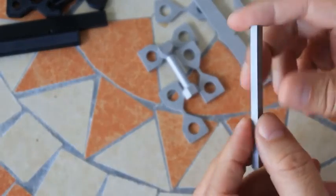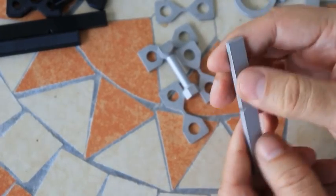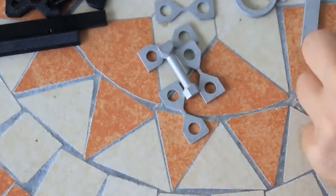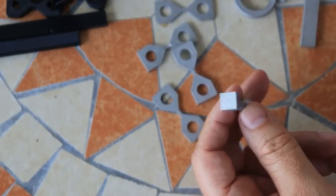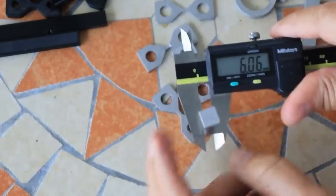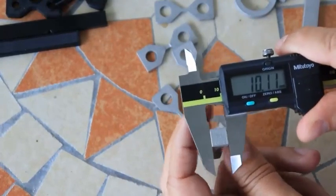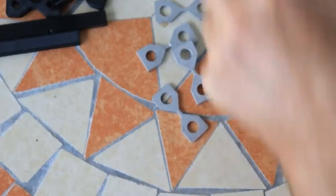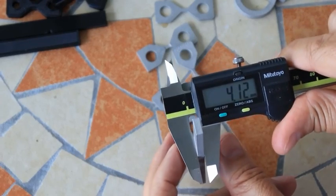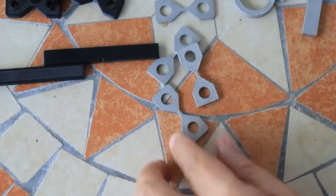Probably this will not bend at all and I'm not sure I can bend it in my experiments, but this is a comparison video. I'm sure this will not break under my half-kilogram hammer — maybe I'll start immediately with the one-kilogram hammer. Let's check the dimensional accuracy: the 6mm diameter measures 6.06mm, very accurate. The 10 by 10mm specimen measures 10.1 by 10.1mm, and 10.09 by 4.12mm — the accuracy is actually better than with the ABS parts.